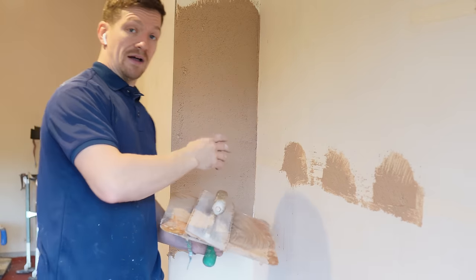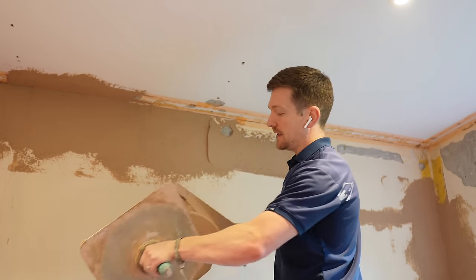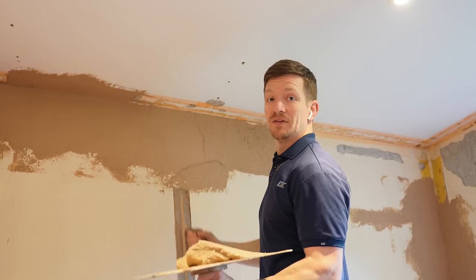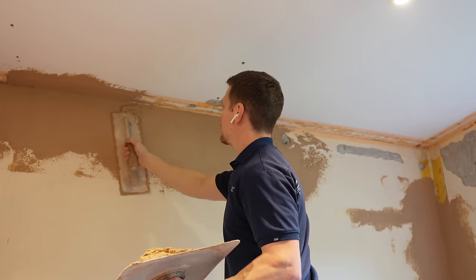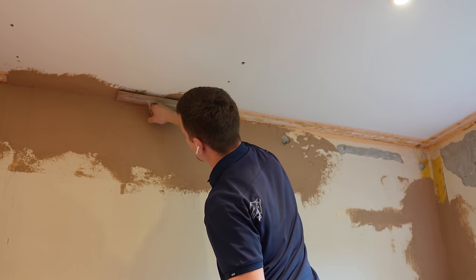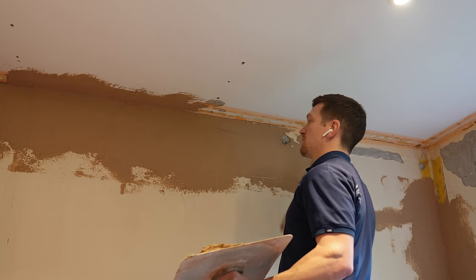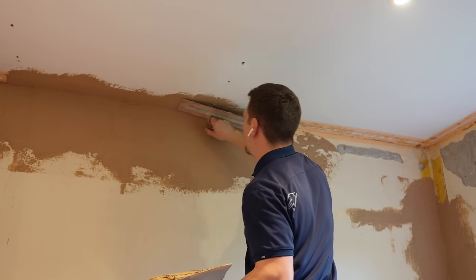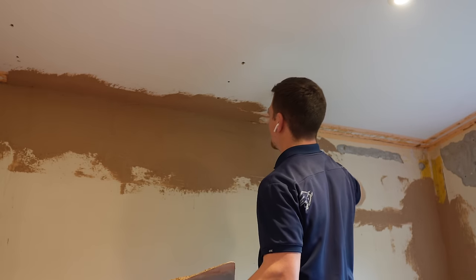Any building out, do it with the bonding during prep — before you start skimming. Plastering is stressful enough without worrying about this stuff. When filling along the tops, make sure you go both horizontally and vertically, because even here I can feel dips in the wall. We're never going to completely get them out unless we float the whole wall, but try to build out as best you can. It makes all the skimming so much easier. Everything we can do to make life easier during skimming is worth it — it's all about preparation.